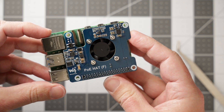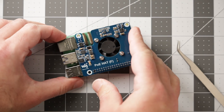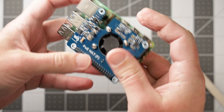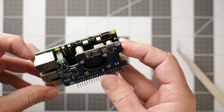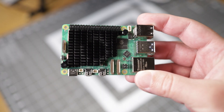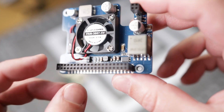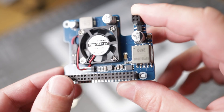Let's take a look at a couple of PoE hats. A lot of people think PoE hats are only for setting up a server rack with multiple Raspberry Pis, but PoE hats really shine when you have to tuck a Raspberry Pi somewhere where Wi-Fi is poor and there's no mains power. The WaveShare PoE hat was the first PoE option available for the Pi 5. It comes with a small fan and heat sink, though it's not compatible with the Pi 5 active cooler, which is a bummer since the fan runs at a fixed speed and is a little loud. It also has a header that provides 12 volts up to 2 amps, though I'm not entirely sure what most people would use that for.